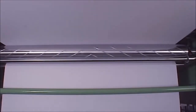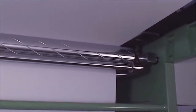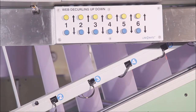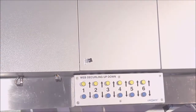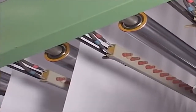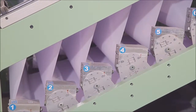The machine is equipped with an automatic motorized decurling unit to remove the curling from the paper and to make it flat for accurate cutting and stacking. The decurling arrangement is for each web with square bar or rollers, and control is possible both in auto as well as manual mode with motorized operation while feedback is displayed on the touch screen panel. Each web has an individual edge sensor to control the position of the web, is provided with static removal, and passes through L-Core compensating rollers.